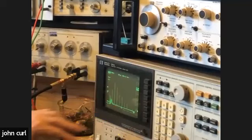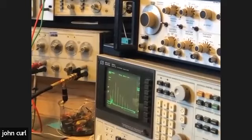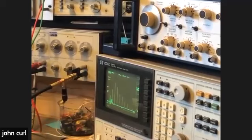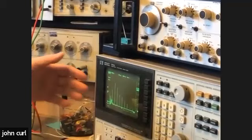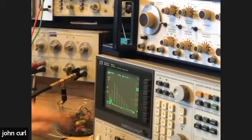It's pretty darn small, 0.01% or something like that. And even though the machinery brings it out, it's not a very high level. Remember, this is all logarithmic. This is all compressed so that you can get it all on one screen. If I put it on a linear scale, you wouldn't even see any of this stuff. It would just disappear because it's 100 times, 200 times below the peak here.